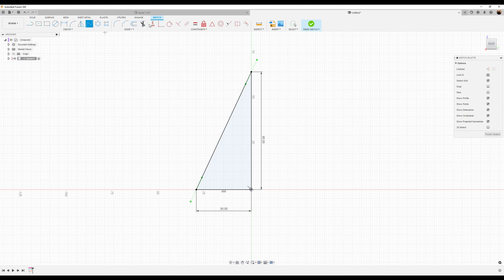Let's go ahead and give this handle a vertical constraint. Then use the dimension tool, select this handle, and make the angle from this handle to that side line 69 degrees. Let's give the handles some dimensions — we'll make this 20 millimeters.